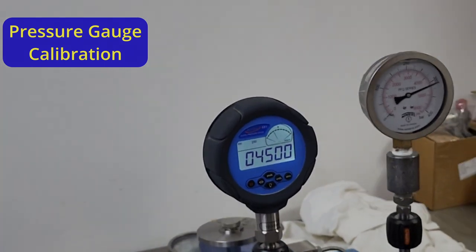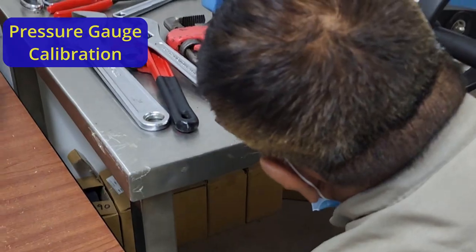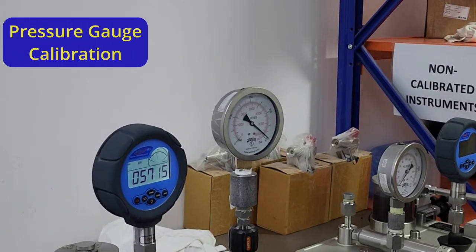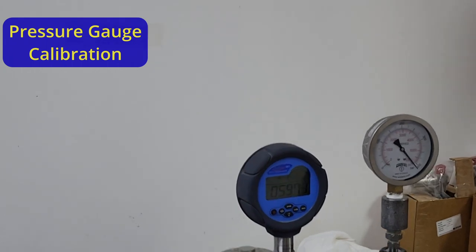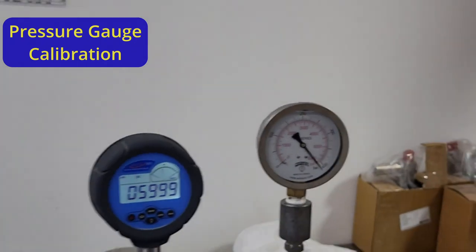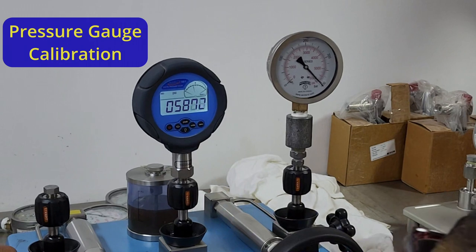We will now gradually go to 100 percent of the range. The tools used here are basic hand tools, so there is nothing much to it. This shop is approved for site hydro test purposes — pressure gauges and relief valves used for hydro test — and it also handles permanent calibration for electrical instruments like PITs and TITs. Now it is 100 percent of the range, and as you can see, the gauge is very nicely calibrated with no adjustment required at this moment.